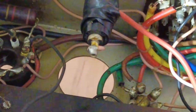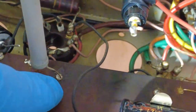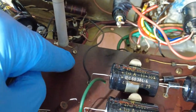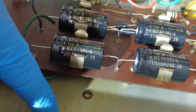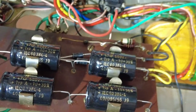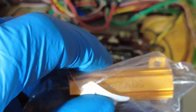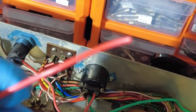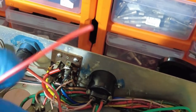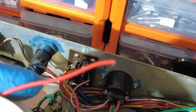I'm going to solder wires into the eyelets — on this one the eyelets are still pretty good, unlike the last one where they were virtually destroyed. I'll bring the wires underneath the board, bring them up, drill out and mount our resistor friend there. He gets just about lukewarm when the amp is running correctly. I'm going to use single-core 18-gauge wire for that.